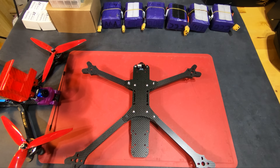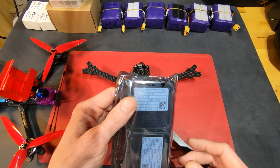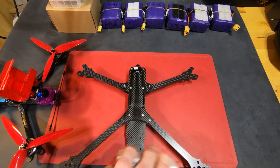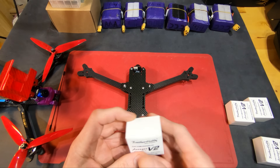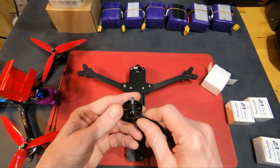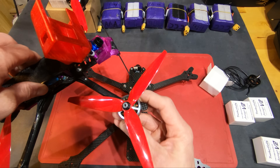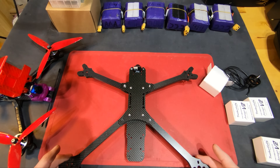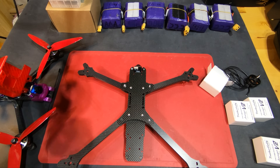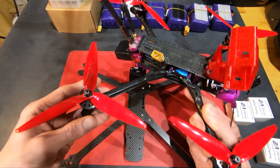I'm planning to use different electronics for this one — the SpeedyBee F7 Twin G and a 50 amp BLHeli32 ESC. I'm going to try running it on 4S to see if I can get a little more efficiency, with slightly smaller motors using the Brother Hobby 2507. I'm also going to temporarily move the current motors over to compare amp draw with the new stack versus this stack, since I should be able to draw way more than 45 amps with these motors.